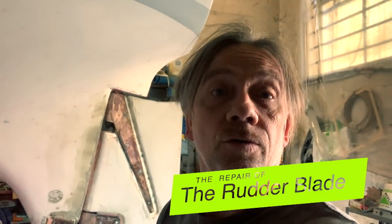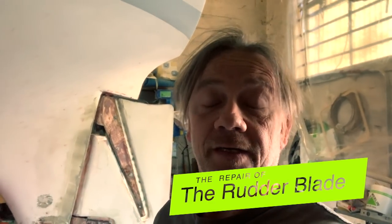I'm still here to work on the rudder of Ellös. I will show you what I did yesterday, because I'm preparing to laminate the rudder and fair all of it. But at the moment I need to fill the gap. I don't want to use too much epoxy fairing, because it cracks with time. So now we will see.